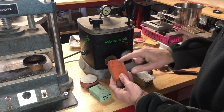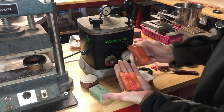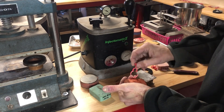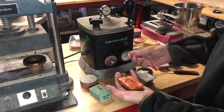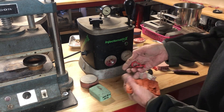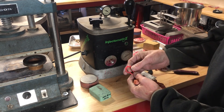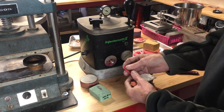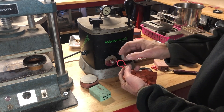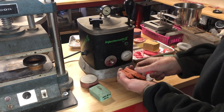Here's one — I've got the top. I'm going to open it at this side, pull out the inside of the ring, free this up, and pull out my wax. When you cut the mold, you want the parting seam to not show up on the surface of your wax. You'll want to have it along the edge somewhere so that after you cast it, you have as little cleanup work as possible and you don't have a seam sticking out down the center of your ring. This one actually does have a seam, so I didn't cut this too well, but it works okay.